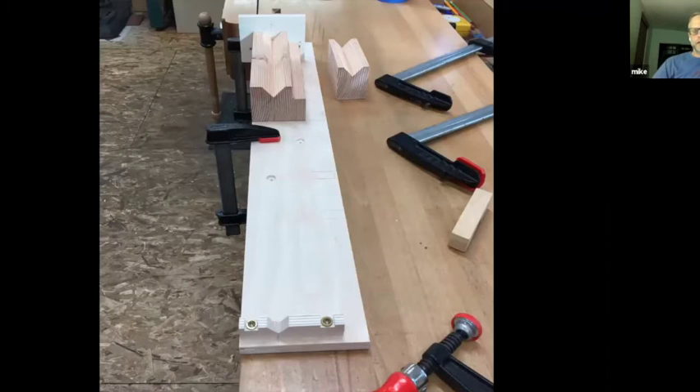This is a pretty basic setup. I'm using some blocks with 90-degree V-grooves milled in them, which allowed me to hold the leg rotated 45 degrees from a normal bending setup. There were some variables I worked out through testing — like how thick this block was, where it was located — and how thick that block affected how much bend I put into the leg and where the bend occurred along its length.